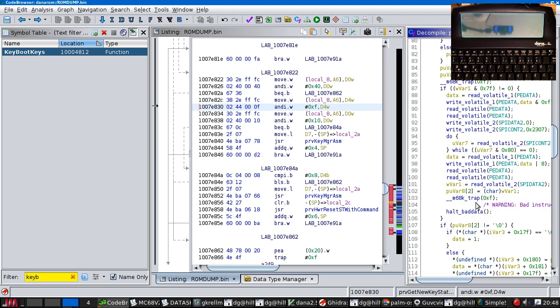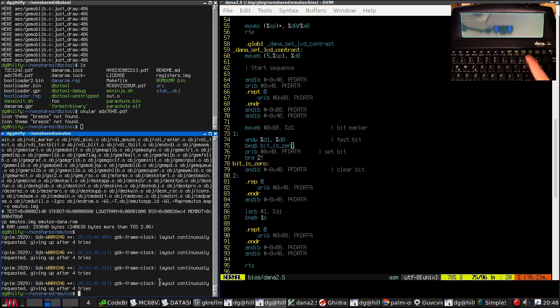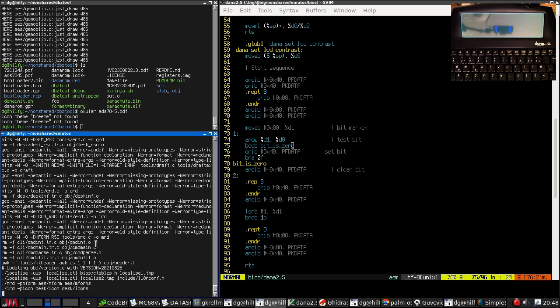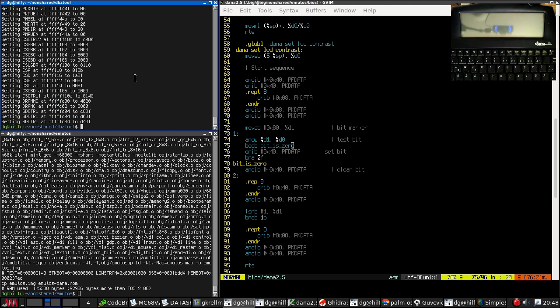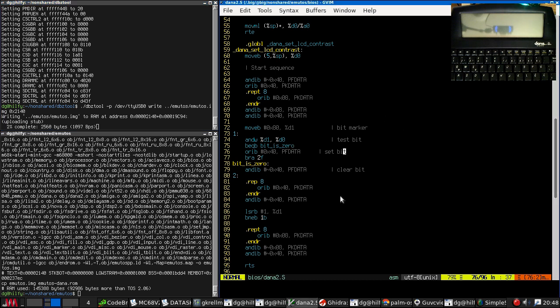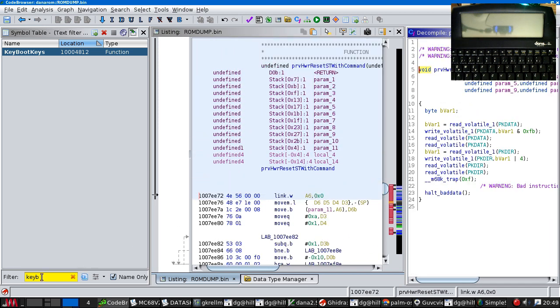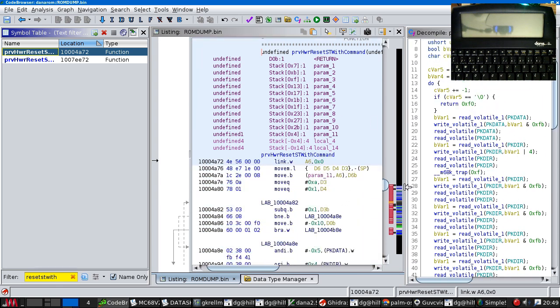okay, well, I think the first thing to do is, you notice that this thing is displaying the GEM desktop, and we're not going to bother with that, so let's just rebuild that without the AES. Reset and write. Meanwhile, over here, we want to find the reset code. Let's find the other one. This one. Because this one we've filled out the trap so it decompiles moderately correctly.